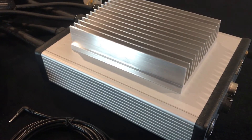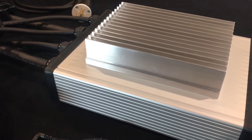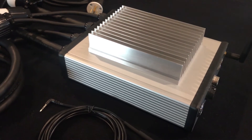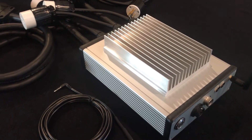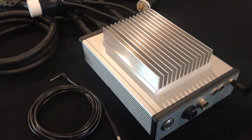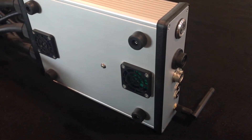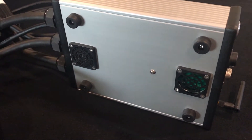Automation is the next stage in brewing which helps you not only brew faster but much more consistently and repeatedly. Another configurable selection is passive cooling, which includes the external heat sink like in this model, or active cooling where there is no external heat sink and the SSR is cooled internally via a fan. In both models, a case fan is integrated to keep the internal electronics additionally cooled. The final option is mounting — rubber feet are standard but a DIN rail kit is optional should you wish to mount the Uniflex on a wall or plate.